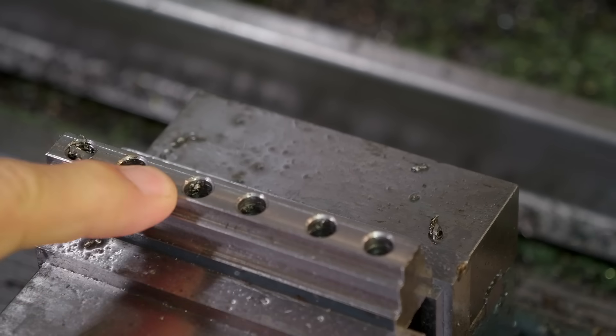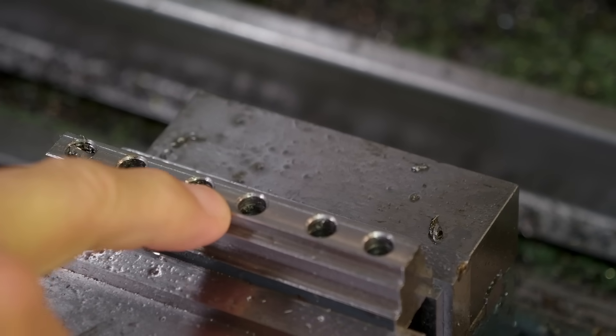On the one hand this is not a very valuable part — I could still save at least two nuts. Now before I try and mill out this broken tap, I think I'll continue and just finish tapping all the other holes, because if I do break a second tap I then have the option of milling both out at the same time or scrapping the part and starting again. If you find this part boring and you're only here to see where the milling out of the tap works, take a look in the description — I've got chapter markings and you can jump straight to the tap removal.